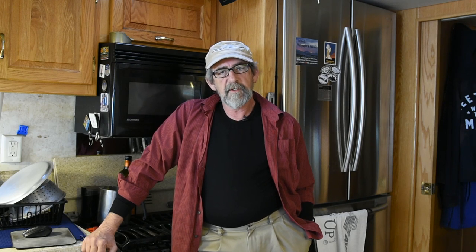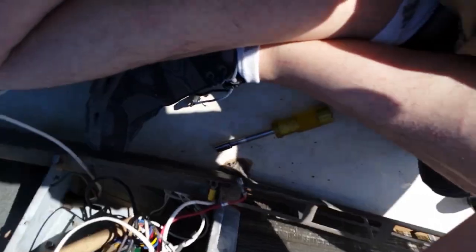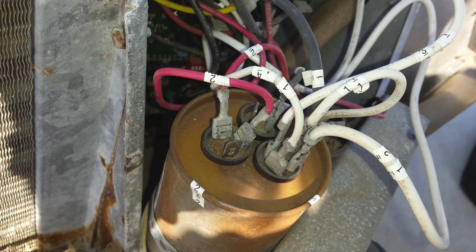Basically, I installed it. When I got up there initially to look at it, I realized that these capacitors were in a metal tray that you could take screws out of and lift the whole tray out. That looked like it was going to make it a lot easier to service. I ended up doing that. But before I took it out, I took care to number what wires went to what terminals on the capacitors. If you look at the capacitors here, I installed a piece of tape — it just has numbers on it. It's an electrician's wire numbering tape.